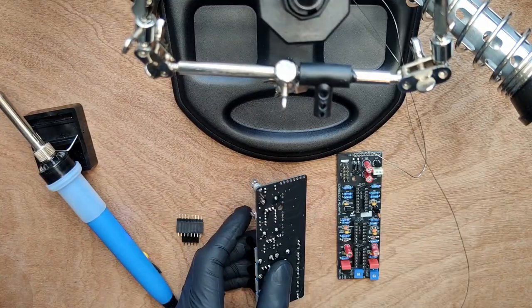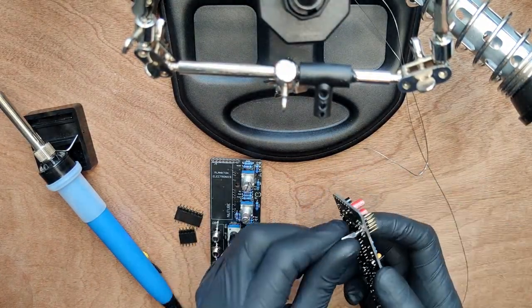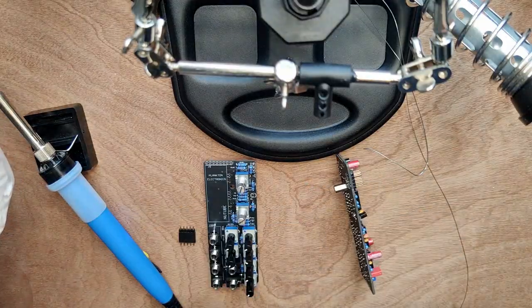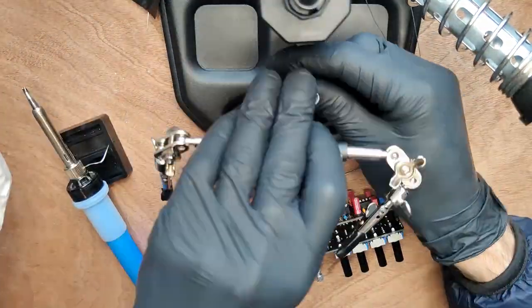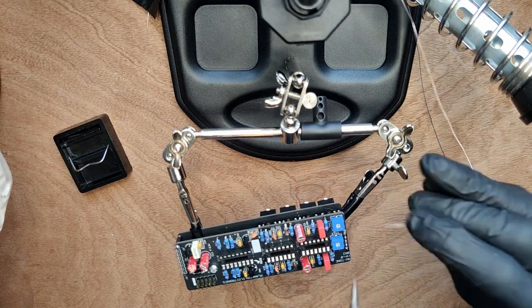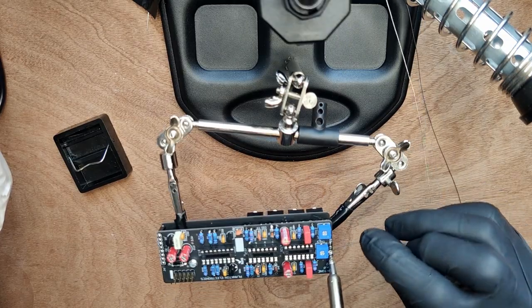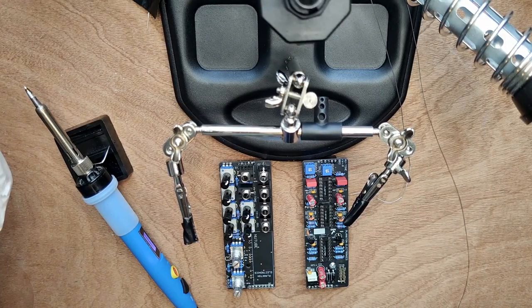Now we're going to connect the 2 boards. Place the screw and spacer on board 1. Place the male and female headers on the bottom side of both boards. Solder both boards at the same time, starting with the corner pins of each header, and take them apart again.